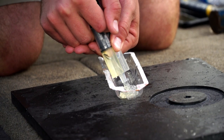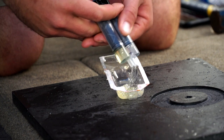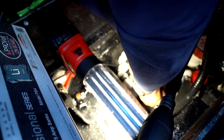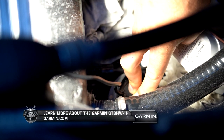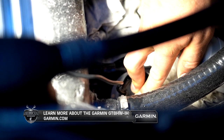Now I'll start with my epoxy. I'm using the pouring device that comes with it — some guys just use a little plastic cup. We'll mix it up until it starts getting a little warm, then take it down and dump it directly into the dam, making sure it all gets in there. Once it's leveled out, I'll take my transducer, push it into the dam, and turn it 90 degrees. Spinning it 90 degrees will smear the epoxy and make sure no air bubbles are still residing inside as it hardens.